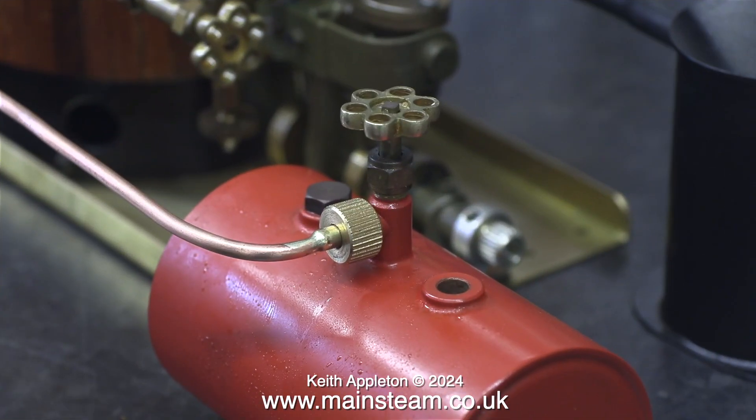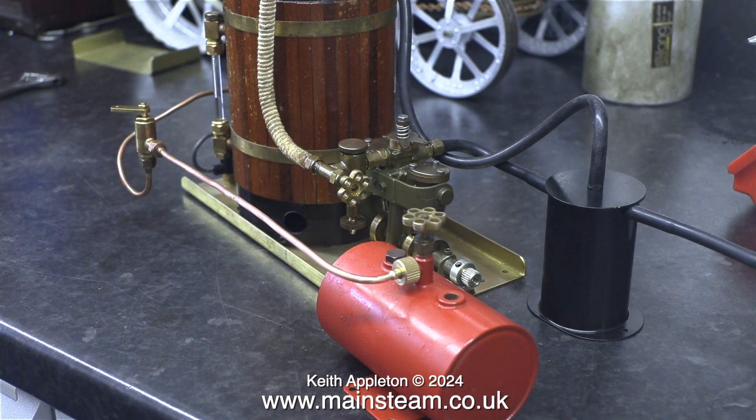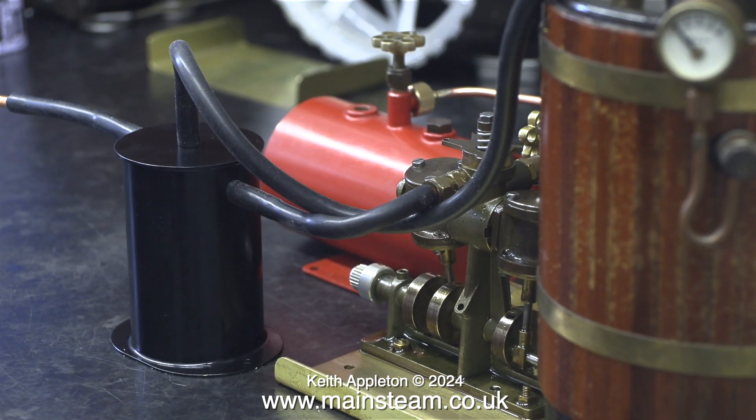Back now in the small workshop that's built onto the kitchen. First thing I did was to bend the end that I've just silver soldered to 90 degrees — it's really easy to bend because the silver soldering anneals the metal and it's now very soft. Then I unbent the other end to straighten it out so it fitted on the gas valve. The valve on the pipe is the emergency gas shut off valve. I piped the new condenser in place as you can see here, piped using silicone rubber tubing.